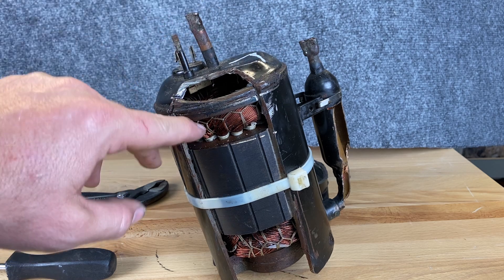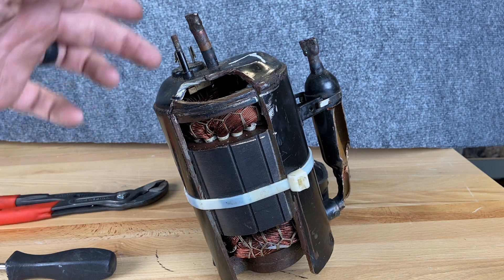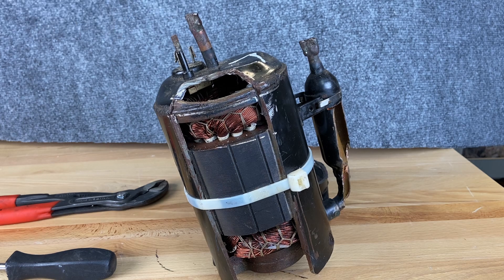The whole entire casing is high pressure — that's why it's so thick. Suction line accumulator always comes with it. Discharge at the very very top. Easy to identify.